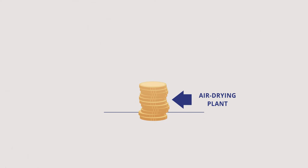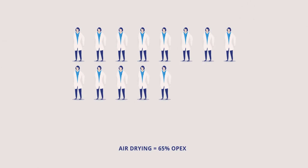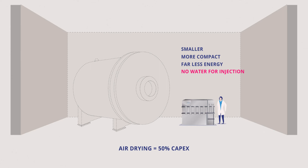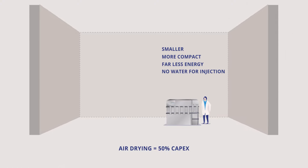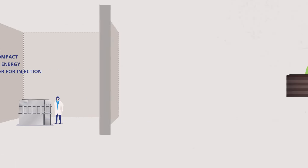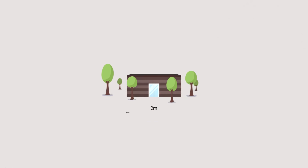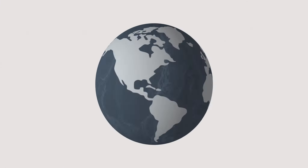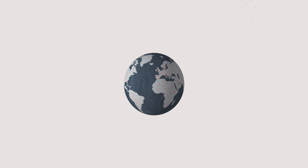But in an aseptic air drying plant, those costs are halved. Half the number of staff are required. The central air drying unit, operating in an aseptic room within a room, is smaller, more compact, and requires far less energy than an industrial freeze dryer. And no water for injection is required — at all. These savings mean that the actual plant itself can be agile, energy efficient, and compact. A modular air drying fill and finish plant would measure 36 by 27 meters and could be manufactured in less than 24 months on any greenfield site anywhere in the world.